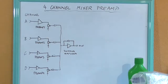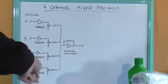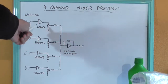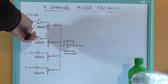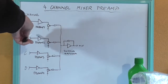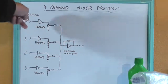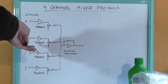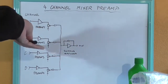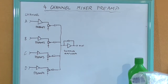Basically, this is our block diagram of the front end of the mixer, and these are all the potentiometers, the 4 of them, for each of the channels respectively, and each channel has its own separate input preamplifier. By changing the feedback and gain structures of each of these preamps, we can get various different amplification ratios for different types of devices such as microphones and guitars, etc. And for line input you would probably have very little to no gain, so unity gain basically on one of those channels. But we leave the preamplifier there so it can be versatile to be changed to whatever we want.